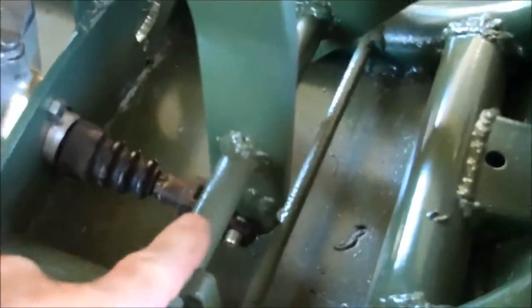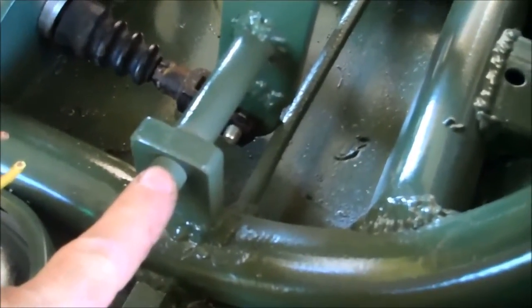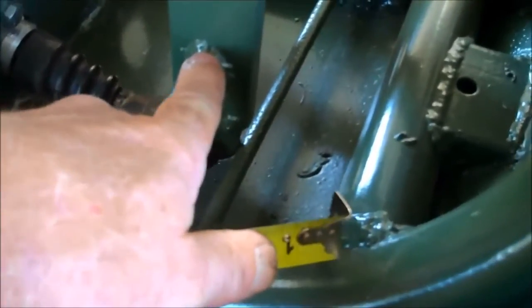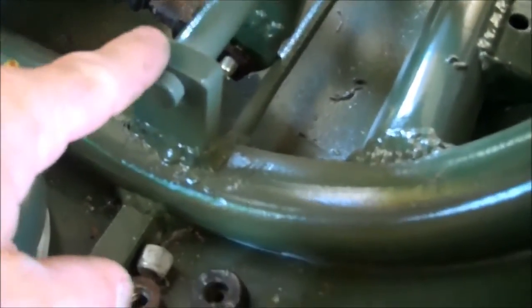You'll need some tubing — less than a foot of tubing that goes over the shaft in the center, so it needs to be a nice close fit. These tubes are welded on each side of the pedal, then it's split in the middle and welded on each side of that pedal, so that your pedals go in and out on the shaft. More tab material here.